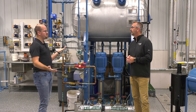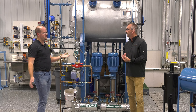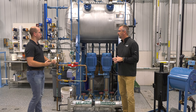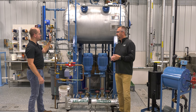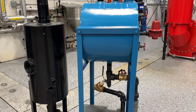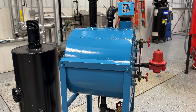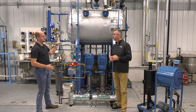The main difference in these applications is that we usually won't see atmospheric feed water systems unless it's a relatively small boiler — typically under 300 horsepower is kind of a general rule of thumb. That's where we'll see those smaller, less critical applications. But if you're going to have a bigger boiler, running at higher pressure, or running the boiler really hard, a de-aerator is really going to be a better solution. Those atmospheric systems are a lot cheaper and won't have as many maintenance concerns — fewer parts to fail and they don't need inspections as regularly.